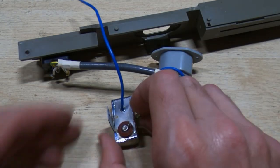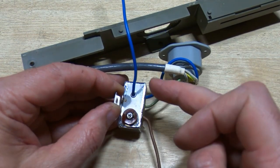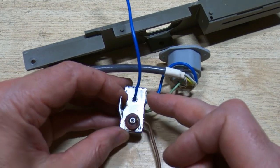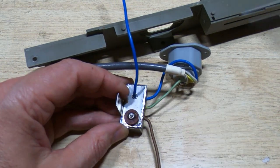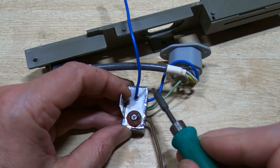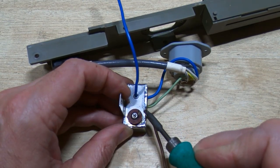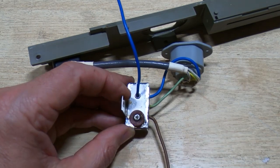The unit is resealed. I've put a couple of XY caps in there — effectively one across the live and neutral, then one from the live to ground and neutral to ground. To resolder the cap, you get a large high-capacity soldering iron set to about 340 degrees, put some standard solder in there, and then slowly bring it down the seam. If you run it at the right speed it will make a very nice job of soldering the plate back on.